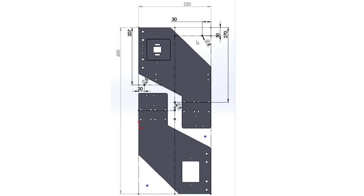And here are the positions of the holes where I will drill through and use some screws to fix the stock to the waste board so it doesn't move. I also make sure that I have enough space between the holes and the edge of the pieces so I don't cut into the screw when I mill the pieces out using the 2D contour here along the outline. I will share this drawing in the description of the video.